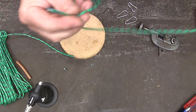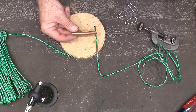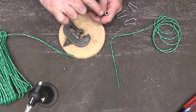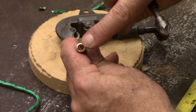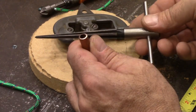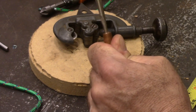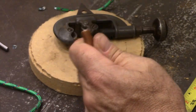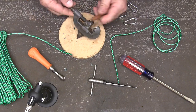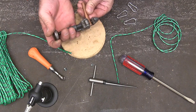I've got my cord cut. Now I need to make the ferrules that are going to crimp on there. This is just a piece of 3/8ths pipe and I'm going to cut a piece about 3/8ths long. Before I do that, I want to deburr — when you cut these, you roll a burr to the inside of the pipe, and if you crimp that down on the rope you'll actually cut it. You can use a deburr tool or just a screwdriver twisted around in there. You can also cut these with a hacksaw, but you'll probably wind up with a bigger burr and need to sand the ends a little bit.